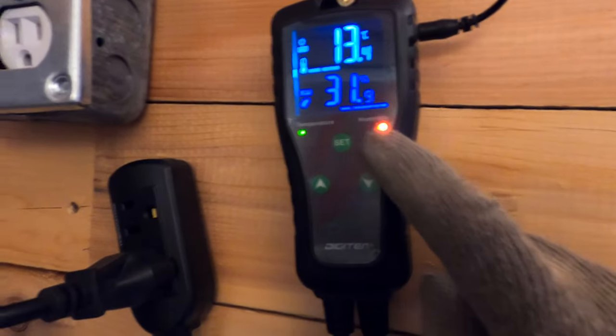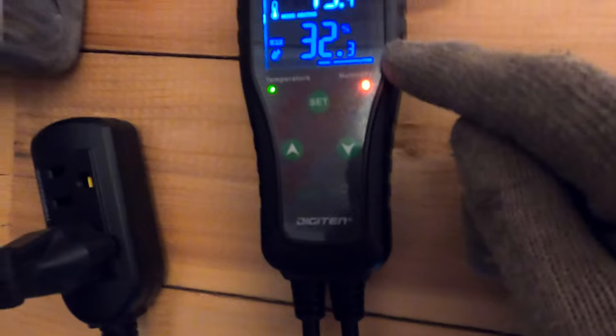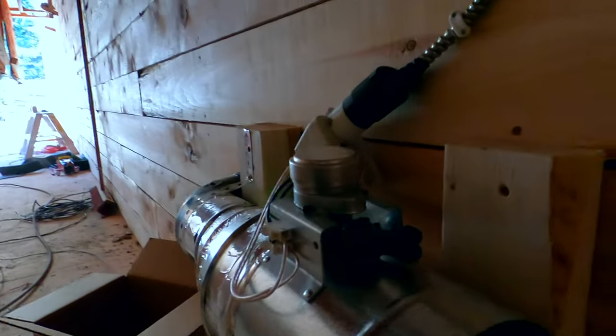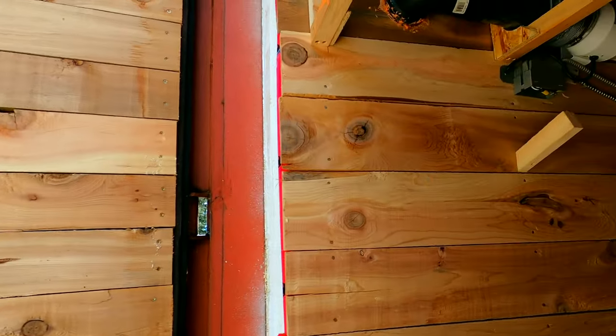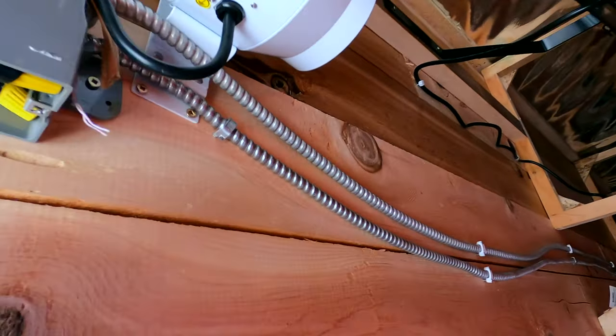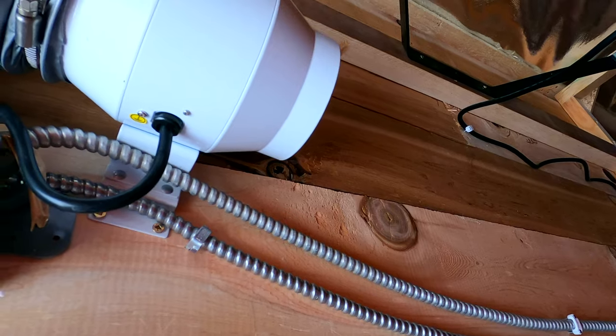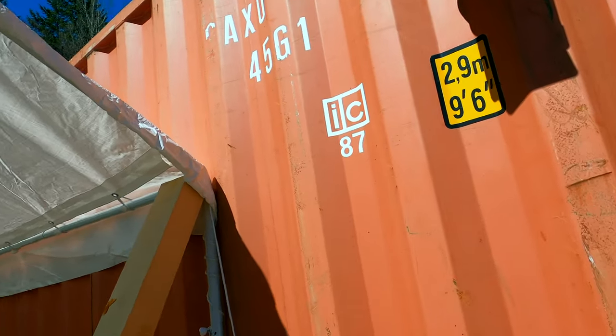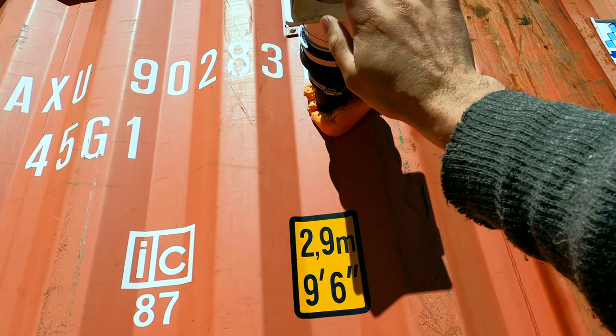The red light here means there's no power running to the humidity control. I've switched to dehumidification mode. I've set some pretty high values — it turns on when above 45% humidity and turns off below that. It's surprising that it worked on the first try — well, of course it worked on the first try.